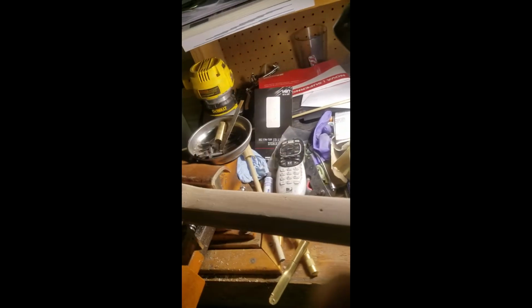Alright, moving right along here. Getting things cleaned up, trued up, squared up, maintaining contours, sanding out divots and dents. Still using the 150 grit. I'm just kind of going over the whole thing right now. It didn't make a whole lot of sense just to work on the fore end, so kind of going behind myself.